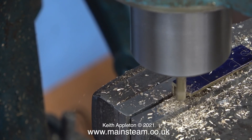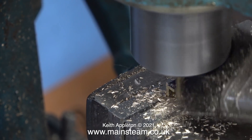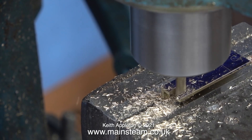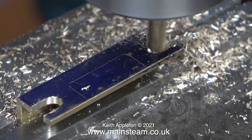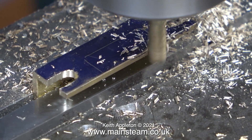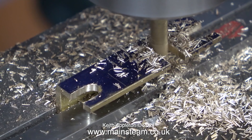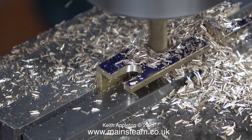Even though I'm making two of these pieces of brass angle, it's still a very quick and trouble-free job. The hardest part is seeing where you're going because there are quite a lot of chips flying all over the place — usual warning: try not to touch these because they will stick in your finger and it's painful. I machine the slot in one end, lift the cutter, wind the handle to move to the other end, mill the other slot, then take out the center section. This clip is running at 200 percent — twice normal speed — just to get through it a little quicker.